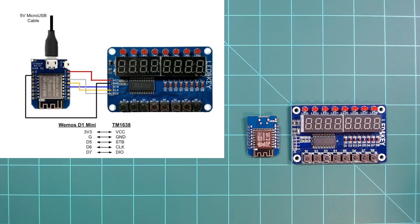Here's the wiring diagram — you can find a copy of this along with the parts list and sample code linked in the video description. We connect VCC to the 3.3V pin on the Wemos D1 Mini, ground to ground, and strobe, clock, and data to D5, D6, and D7. I chose those pins because they aren't involved with any boot process. I chose 3.3V because I couldn't find any specification sheet confirming voltage regulation on the output pins, and the Wemos D1 Mini GPIO pins are only rated for 3.3V.